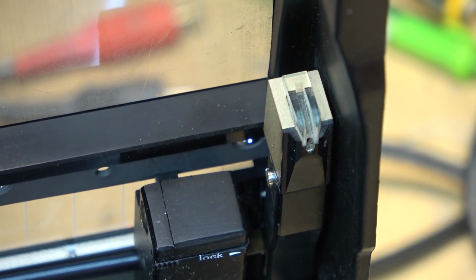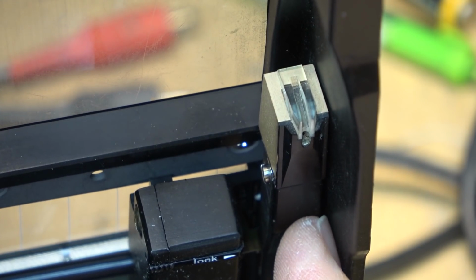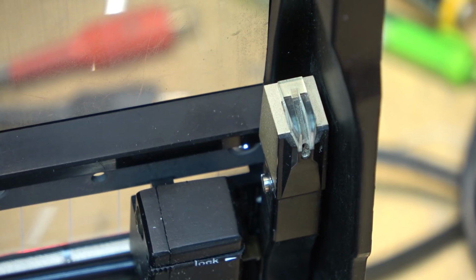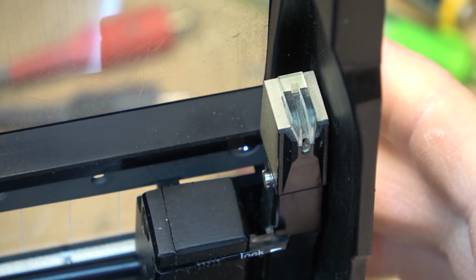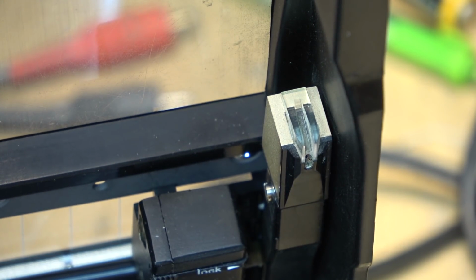Well, it may have at one point had the rare as hen's teeth moving coil pickup, but I don't see a needle, a stylus on this one. It's missing, so that cartridge is foobar. I don't see any sign of it either in the case, but the tone arm had not been returned to its rest position, and it was not locked in place when it was shipped by pushing the lock lever over, which prevents the tone arm from dropping. So I get the sneaking suspicion that during transport, when this thing was bouncing around, this tone arm was slapping down on the platter and has broken it.